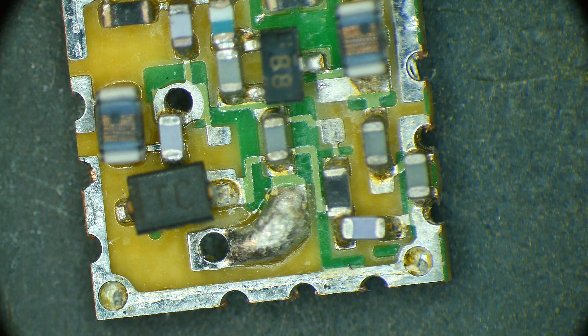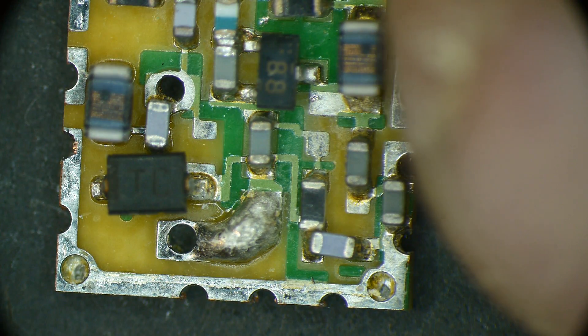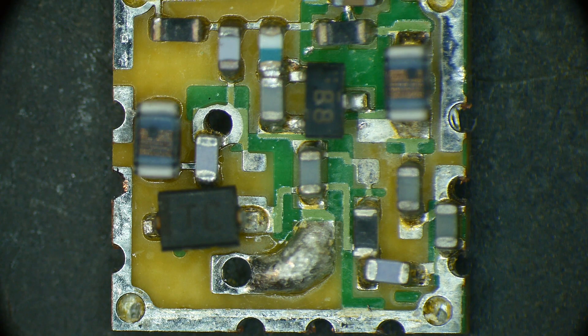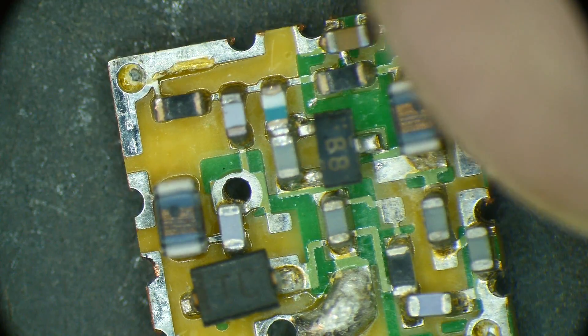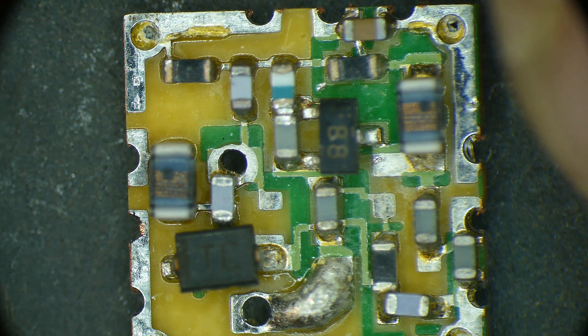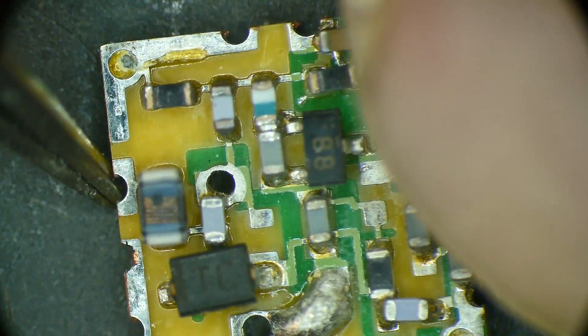I really don't know what this thing is - I really can't figure it out. I did wire it up and I decided it needs biasing, so I put 12 volts at the top where I think it should be, and it doesn't do anything. I thought maybe it's a noise source, but no. It may be that the biasing needs a negative voltage instead of positive voltage - that doesn't quite make sense, but a lot of RF stuff seems to like negative voltages.